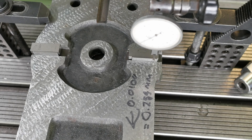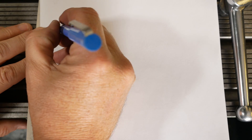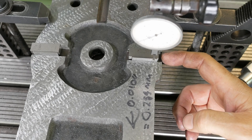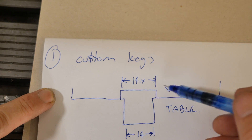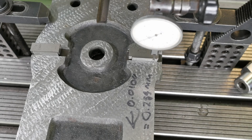A 10 thou error — I wonder how they did that. You'd think if you'd just run a mill straight across you wouldn't get that error. I guess they didn't go through the middle there because that boss is higher. Given it's a cheap Chinese vice, I can picture four options. The first would be custom keys — clean up the slots in line with each other, accept whatever dimension I get, and then manufacture new keys with two widths on them: the width of the slot here and the 14mm for the table. Shame I don't have a surface grinder.